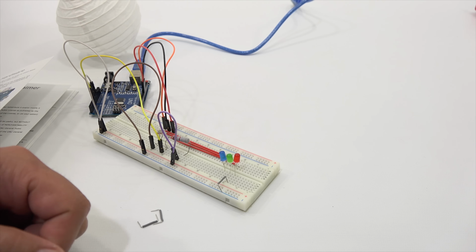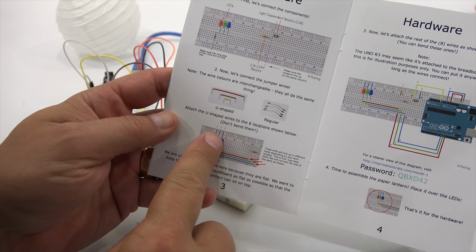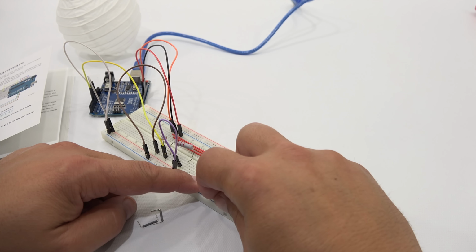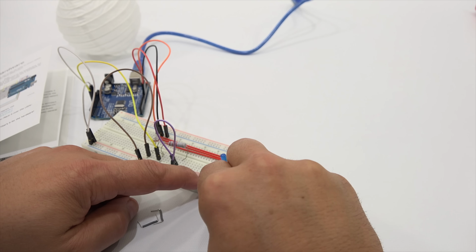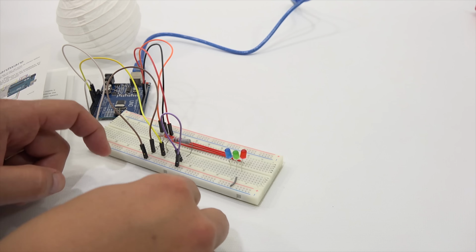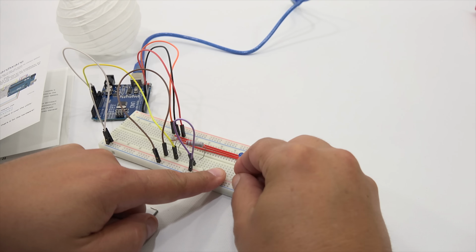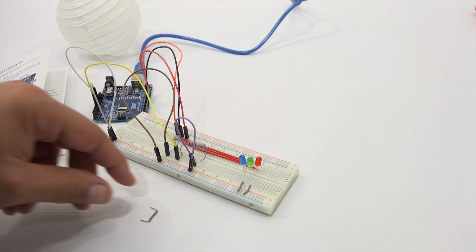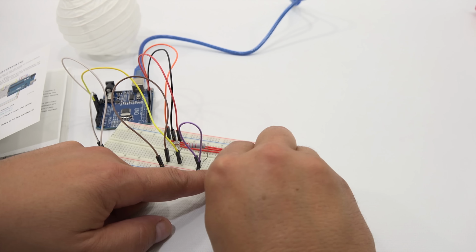Good thing I double-checked. I was going over everything one more time and noticed we had missed these 1, 2, and 3 right there. Those were those little jumpers. I reviewed everything and then realized these need to go in here. So this kind of jumps what I believe to be the power side to the control side. This one's going to go to here and then out here. Okay, so there's one more little jumper. Without that, I don't think this would have worked. So that's why it's good to double check everything and go over it.